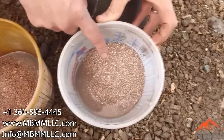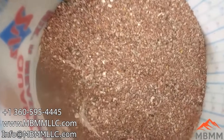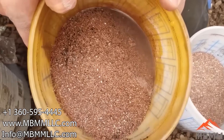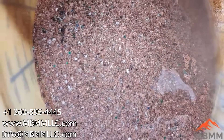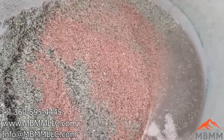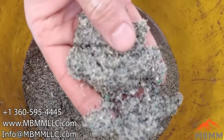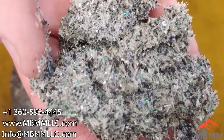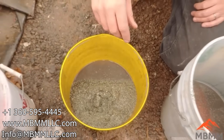Here are our results from the whole populated board, and it looks very similar to the cell phone results. The number one has some copper, lots of pins, white metal — that's where a lot of your precious metals are going to be. The number two has quite a bit more red metal, still a few pins, but a lot more copper. The number three middlings has a lot of copper and a little bit of resin. The number four is mostly 100% plastic and resin. These boards are somewhere in the range of about 100 to 200 grams a ton of gold and about 400 grams a ton of silver.